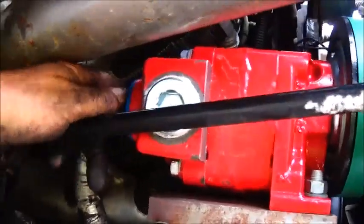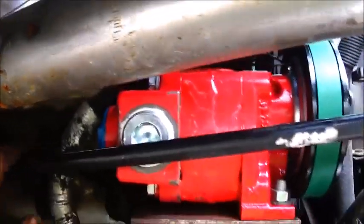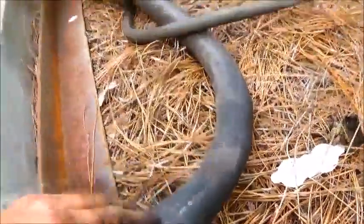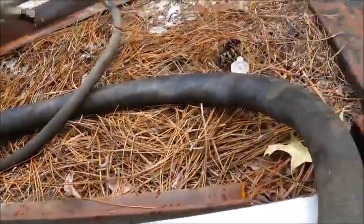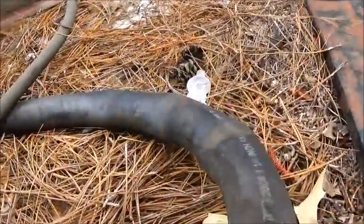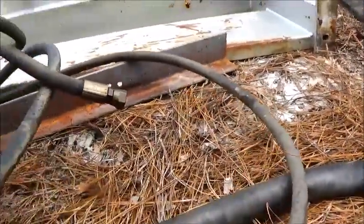I may go ahead and try to get these hoses on. I've got a suction and a pressure line. It looks like I'm going to buy one — I don't like how crushed that looks. We can get the fitting off and get it all cleaned up for the suction line. I was going to try to use part of this and extend it, but I don't want to take any chances on it sucking shut. The bigger three-quarter is going to be the return, the smaller half-inch is your pressure.